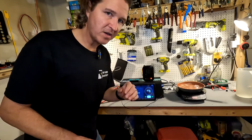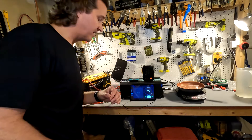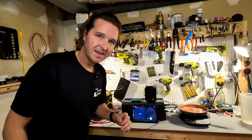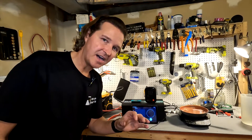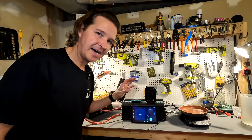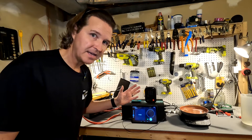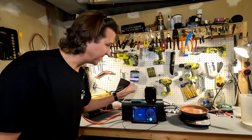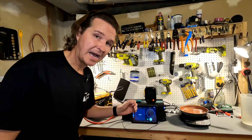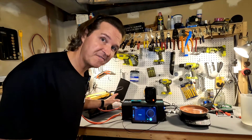Now we bumped the cooktop up to 1,300 watts and the current went up to 120 amps — and it shut off. Perfect. That's exactly what it should do. The BMS says the maximum discharge rate is 100 amps, so if you go over that it should shut off after about five or ten seconds, and it did it perfectly. It turned back on after about 30 seconds to a minute, which is exactly the way I feel it should work.